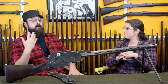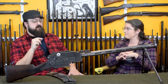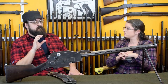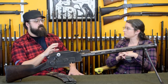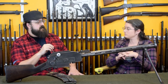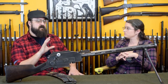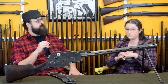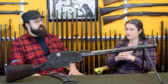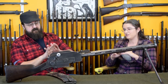But so far in the light machine gun series that we did before with Project Lightning, we said that we really liked the Lewis Gun's short bipod. Yes. I think the Madsen specifically does a very good job of using a longer bipod, which does get in the way a bit, but it uses it well. And again, you can't rock forward into it. It's not as good as a modern bipod, but this is easily one of the top bipods we've seen. I would agree. It allows you to gain that height that we couldn't necessarily get from the Chauchat because it was too far, and where the Lewis did fall short. Yeah. Although, anyway, so we got the bipod.